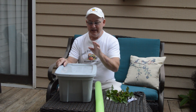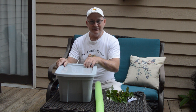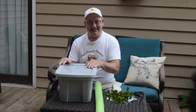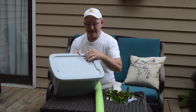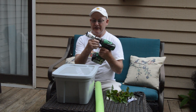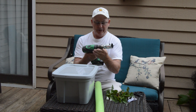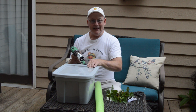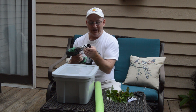The first thing we need to do is drill some holes in this container. I'm going to try to fit in six — if we find we can fit more, we'll try to do that to maximize our space. I'm going to put three on this side and three on this side. We're going to use this inch-and-three-fourths hole saw bit, and we're going to make sure we've got it in the reverse mode because we don't want to tear out as we drill through this plastic. That's what will happen if you have it going forward.